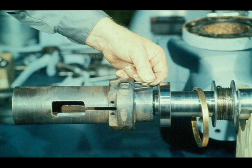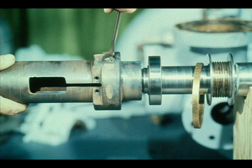It is extremely important that this assembly function correctly, as it could be the only safety device between normal operation and a runaway. The pin assembly should be tested to ensure that it is moving freely in its fit in the governor case. This can be accomplished by depressing the pin with a screwdriver, as shown here, and then allowing it to snap back.